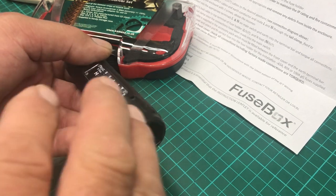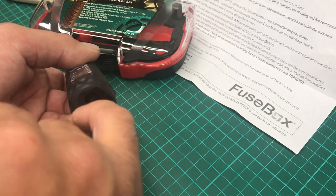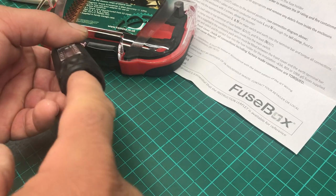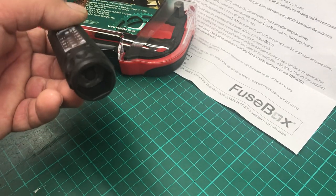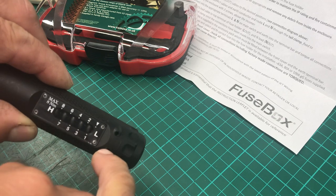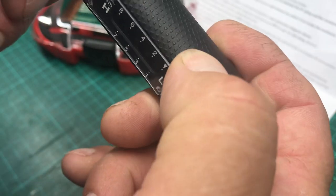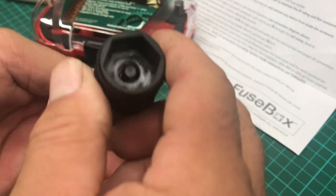But this is just for me to double-check my electrical terminals. If I was using it on a regular basis, I think I would 3D print a hex T-handle to go in there — print it in PLA so it would be weaker than the plastic on the tool itself, and would fail before the tool does. I imagine that hex should be able to take eight Newton meters. It looks like it has a join but it's actually molded — I think it's got two roll pins in there for the spring to sit on. It seems like engineering plastic, almost matte finish, possibly glass fiber filled — looks pretty tough.